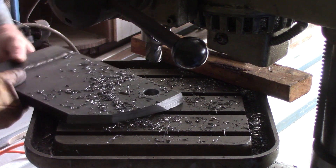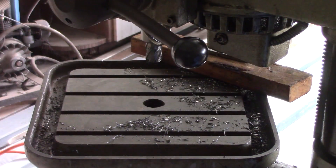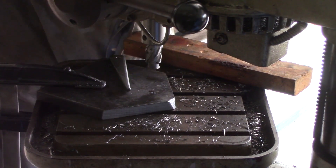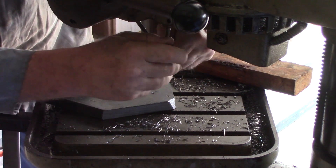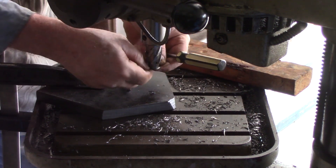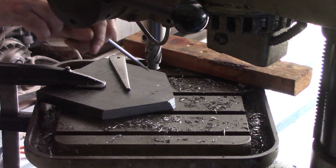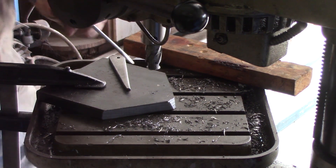While I've got it all set up, I shall go and get the other piece, the splitter wedge, and put the hole in that for the other end of the ram. The Chinese annular cutters — I really like them. The plug's coming out way easier than they do out of the Aussie ones or the American ones that I've got. Must be the design of the cutting blades, I think.